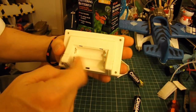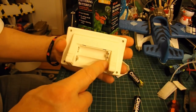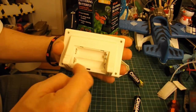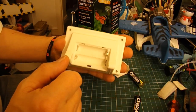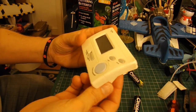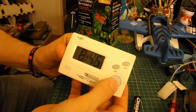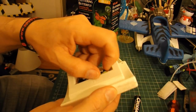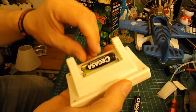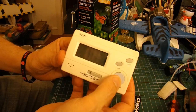I metered it out and checked it out. I expected it to go from there to there, straight across and back, but it doesn't. That point and that point are connected directly together — so the two negative terminals are directly together. It doesn't go the way they normally do. It actually runs off a single AA battery. If I plug it into the other slot, it's still running on a single AA battery.